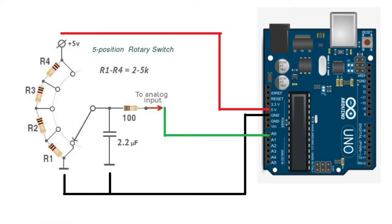Here's a wiring diagram I've created to show how that would be wired up. The 5 volts goes to the top, the ground goes down to those bottom two components, and then we've got the analog input which will go into one of the analog in pins on the Arduino. Any of them will be fine as long as you account for that in the code. In one of my projects I actually had four of these rotary switches set up, so that took up four of the analog pins.